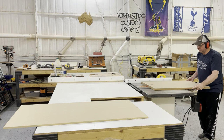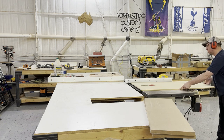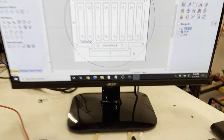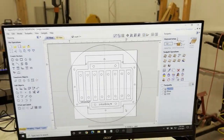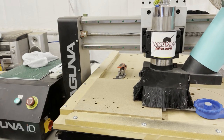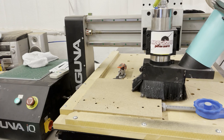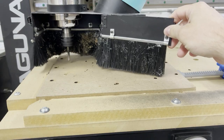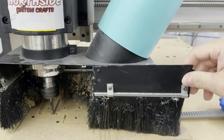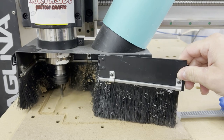For this project I used one-inch MDF that I'm cutting right now, and that other piece is half-inch MDF. I did it because it's cheaper to prototype, and we're going to end up with 12-inch square pieces. I used Aspire software — V-Carve Pro is about the same. These holes around the perimeter are just big enough for a bolt to go in. They're not symmetrical, so this is a three-piece mold that can only go together one way. Those are the holes that will hold the center parts.